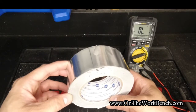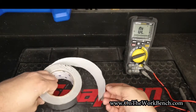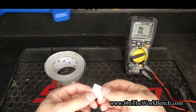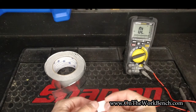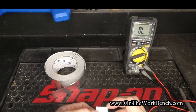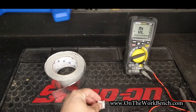This tape here is by IPG, not a sponsor. It's got the shiny aluminum on one side. So here's a little piece of it. This is electrically conductive across its face. However, the adhesive back is not, but that adhesive back may be able to get you out of a bind because of just how paper thin this metal tape is.